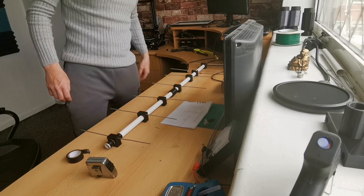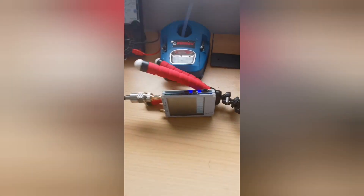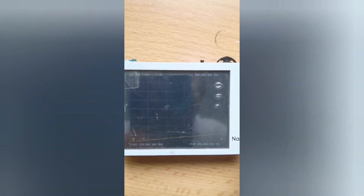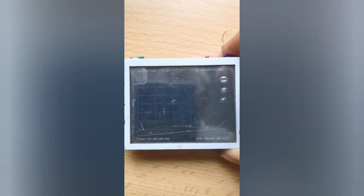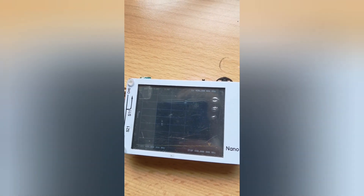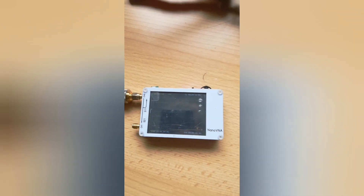I'll be back once we get it on the SWR meter. Right, I'm just resting it on the bench there. We have an SWR reading - let's see if we can get this in focus. 1.25 at the lowest point of the pot at 430 MHz. That's just lying on the bench though - it'll drop if I lift it up. 1.7 up at 435, 1.89 up at 440, and it's a 2 there. But if I lift it up - 1.6 - and it's obviously full right, flat at the bottom of the band. Great job, I haven't had to trim it up or anything. Next thing is to test it on air.